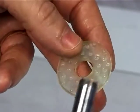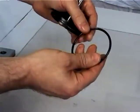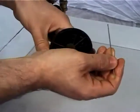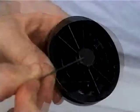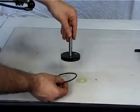Check the wear of both the dampener, figure 33, and the seal, figure 36. Check if the CLA height of the stem is 0.2 RA and verify the wear of the seal, figure 48. Check that the stem screw, figure 37, is properly tightened by means of Loctite number 542.